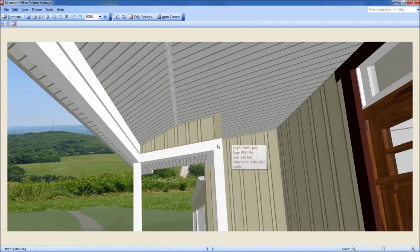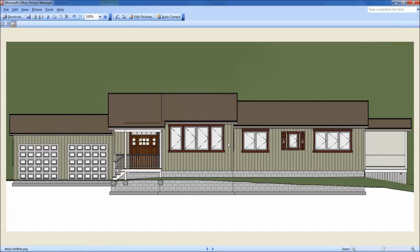Inside, this is a pretty hard detail here, but this is all immaterial, because I don't think you're going to end up with that. So even though this is a more traditional, more rustic kind of look, the siding people will definitely appreciate it if these are just squared off. They could still be like this, where this is a regular sill type element with the casing dying on top of it, and this is a lintel type element, but just where the installation is a lot more streamlined. Now, keeping in mind, you can disagree with anything I've done. I'm just trying to horse around with this in the meantime.